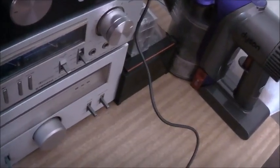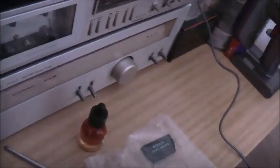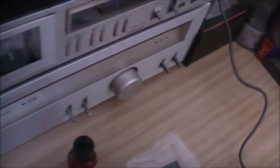The die will be in the centre. There'll be some other discrete components all around it. It's just their design, I think, to have minimal external components. Most commonly used in rear projection TVs and the conversions. They get the absolute arse flogged out of them. That's why they always fail. That's their weak point. You can't play on full blast 24/7. They're the easiest sort of integrated circuits to kill in an amplifier application. That's their only drawback. Other than that, when you look after them, they actually last for ages.